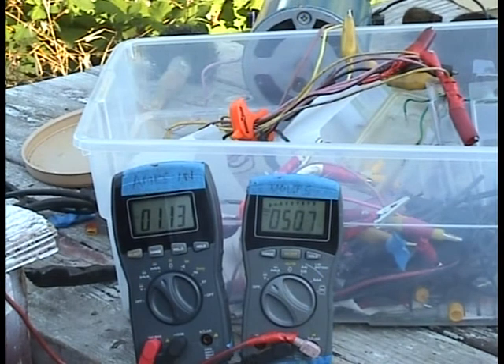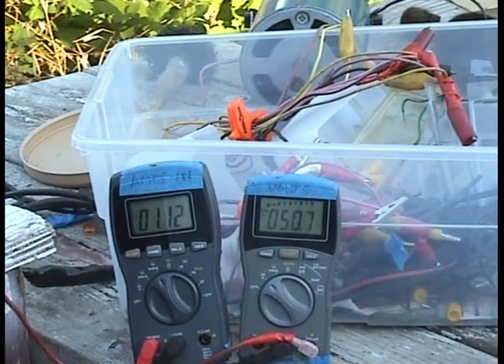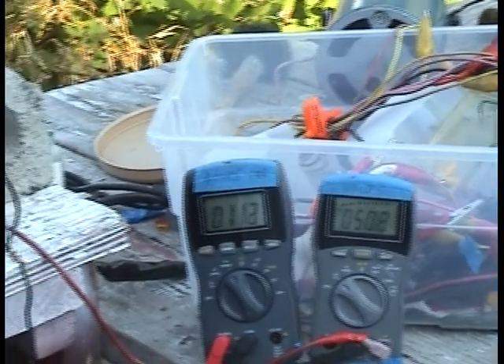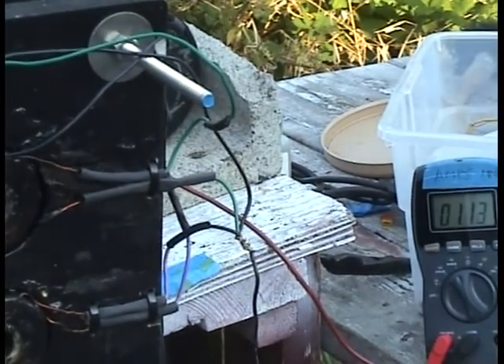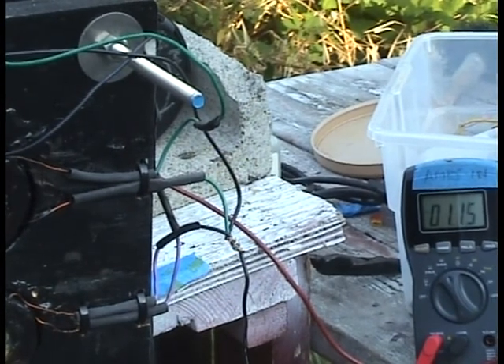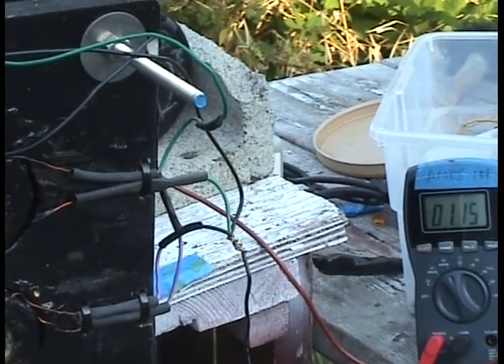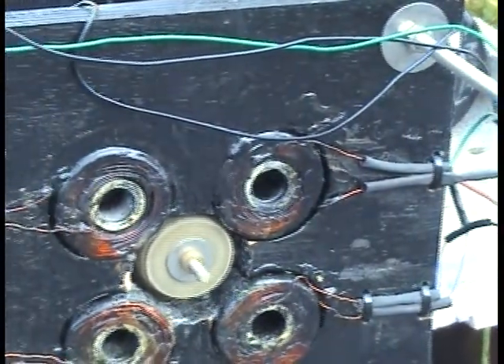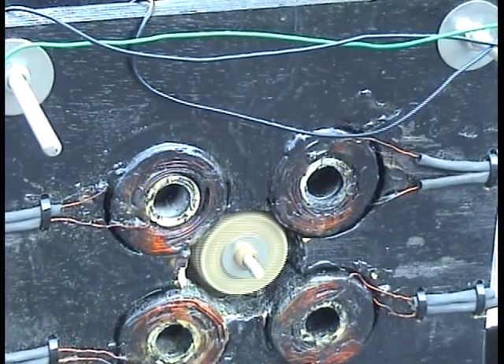Right now I'm running on 50 volts and 1.1 amps. It's just the AC motor plugged into the grid, going through a Variac to cut that down to 50 volts from 120. I also have that 88UF cap in series on one of the legs going to the motor. Here's the motor.